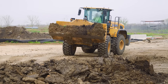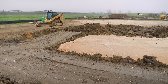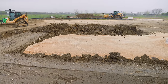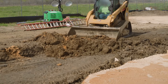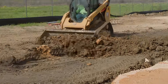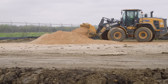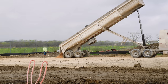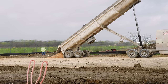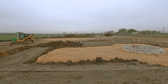At the new lift station across the site, it's time for more backfill. All of this work is still happening under what will be the final grade. Now that all the pipes are installed, the site needs to be brought up to its designed elevation. Anywhere that will eventually get concrete is backfilled with select material — basically road base, crushed rock that interlocks and compacts into an extremely stable subgrade. The other parts of the site that won't support any structures can be backfilled with native clay.